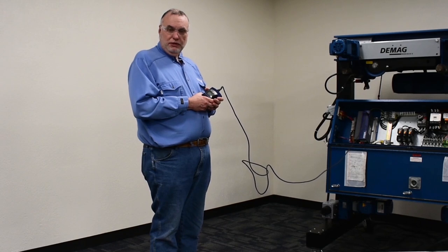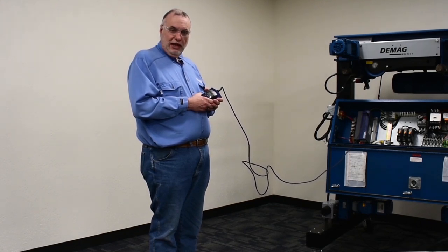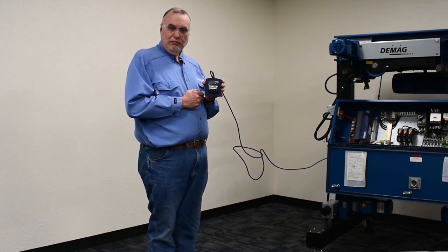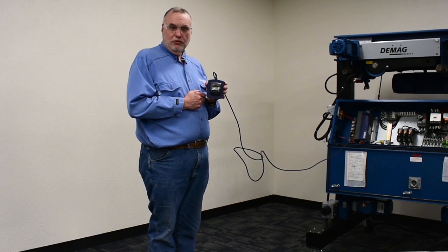So please remember, first check your LED flashes, then check error codes on the KP500. Hopefully this will help you diagnose what's going wrong when there's a fault in your VFD.